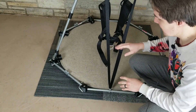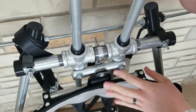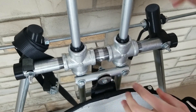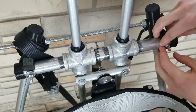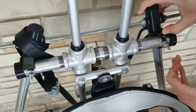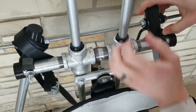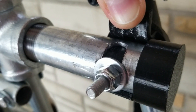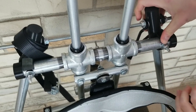This whole thing also supports leaning, so the whole thing can lean forward and back if the user wants. How that works is I cut a few slits — you can see a slit here that the bolt can ride along until it gets to the end of the slit, then it stops the user from tilting anymore.